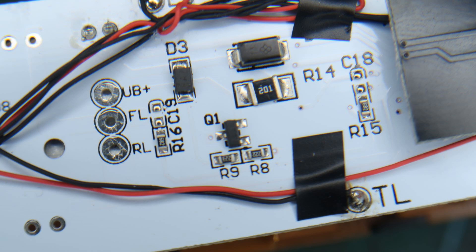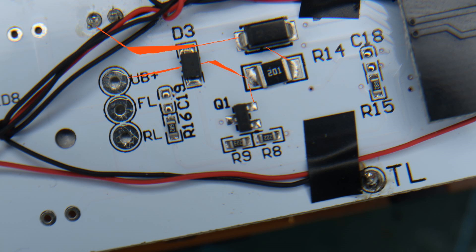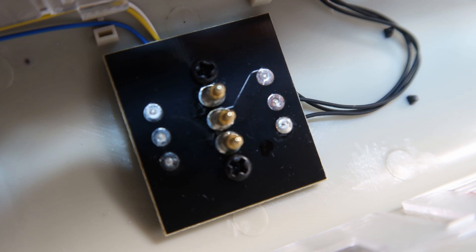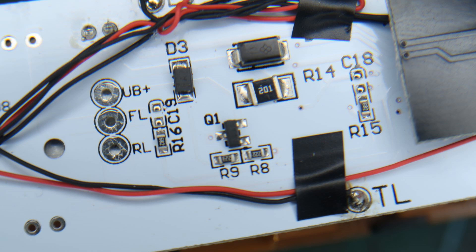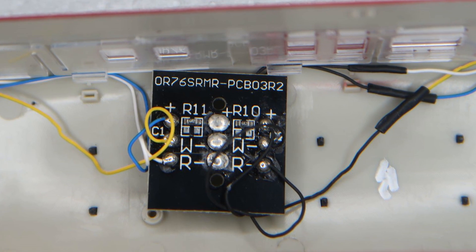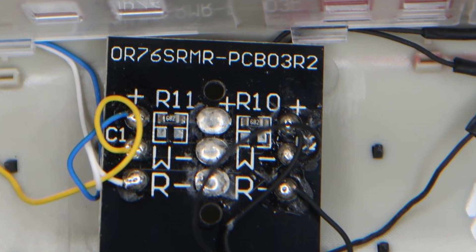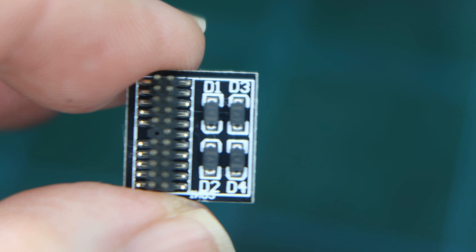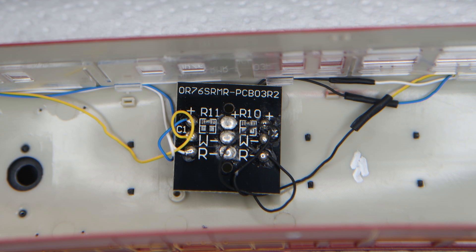Let's look at the circuit on the internal PCB. The PCB is a strange white shiny affair which appears to be double-sided, such that all the tracks can't be traced as the coach lighting units are attached to the underside. However, I have identified that the circuit to the head and tail lamps is as shown now on your screen. In the roof of the model is a small PCB with three sprung pins that make contact with the three landing pads on the PCB marked UB+, FL and RL — the UB+ being the common feed to the bi-coloured LEDs fitted to the lamps. Also on the PCB in the roof are two 6K8 resistors, one per LED unit. The voltage at the pins was measured as 3V, with the switching done by directional diodes on the DCC blanking plate. The 6K8 at 3V is quite large; however I'm convinced it's not enough to both protect the LEDs and deliver a more realistic light output.